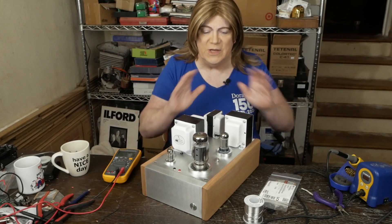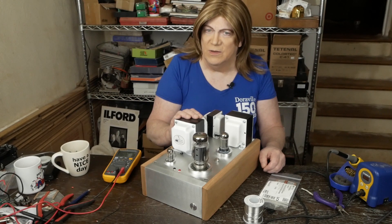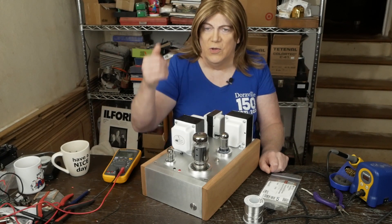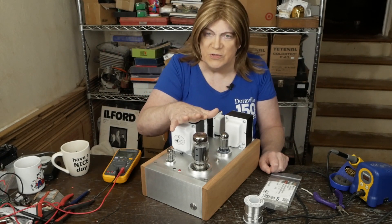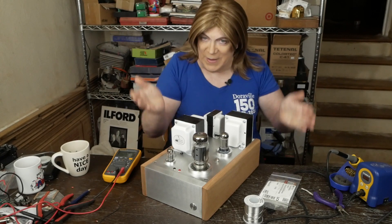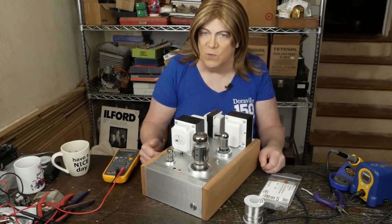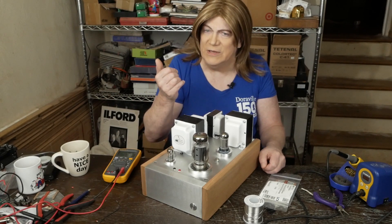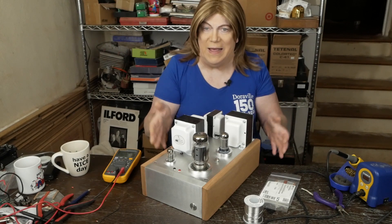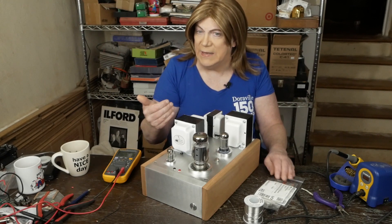I still want to play around with stuff, so we're not at the final design yet, but 14 watts before it starts clipping, which is exactly what I was hoping to see out of this. Given that we're using some output transformers that are a little higher Z than some people might normally use, we should be able to get the distortion down below 2% at that 14 watts, and should be able to hit 11, maybe even 12 watts at 1%. So we should be able to get a lot of really clean power out of this thing, and for my uses I'm probably not going to be using more than about 8 watts.